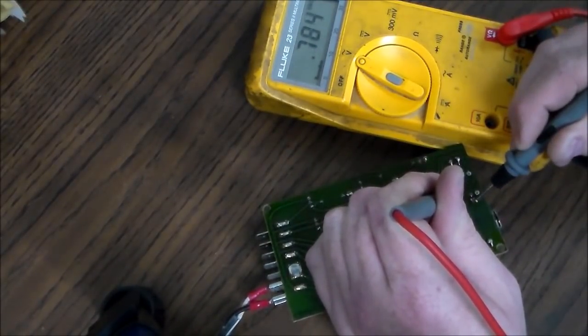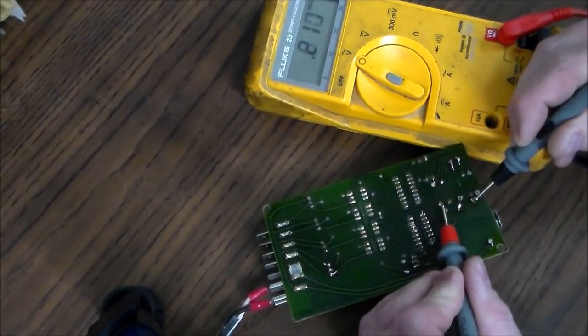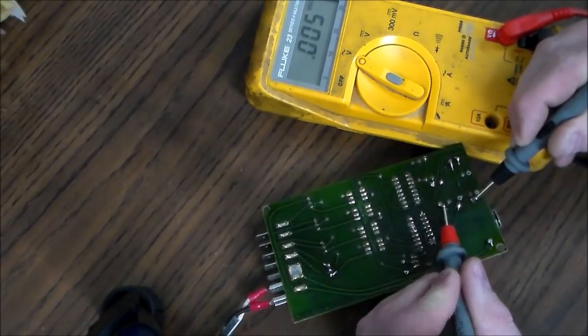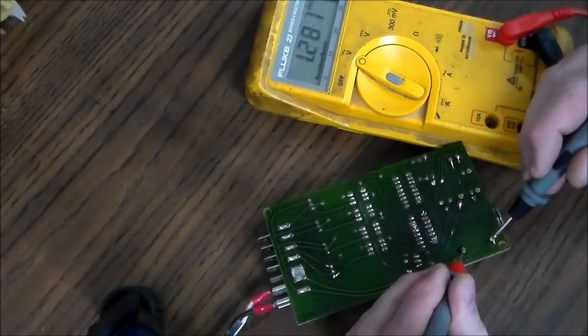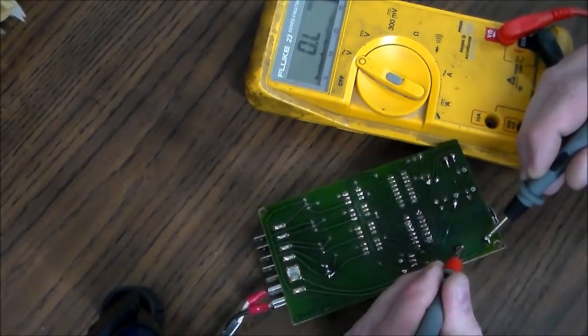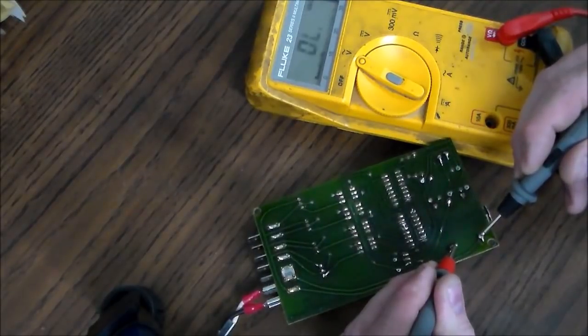which is like the worst possible problem because you can't order these transformers. Well, you might be able to. I don't even know what voltage it's supposed to be making, but whatever it is, it's not making it. So you can see how I'm having a little bit of trouble getting even my AC voltage to read on it. I mean, there it is, but.